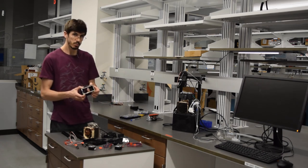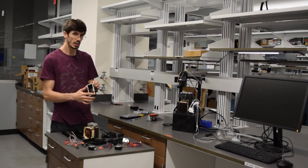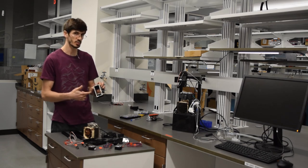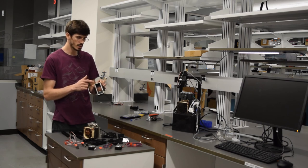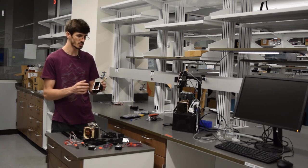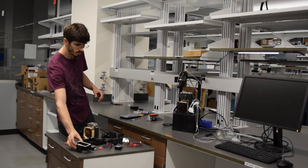The sample block box is 3D printed as an open hollow framed box and I have already used some spray foam insulation to fill it. When you spray the foam in, you want to only fill the walls about 50 percent because it is going to expand. If you use too much you could crack the inner wall, and it is very sticky and makes a big mess, so just be safe with that.